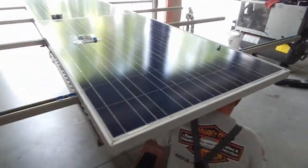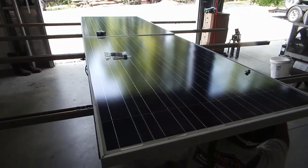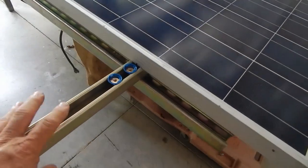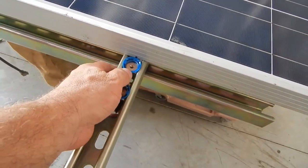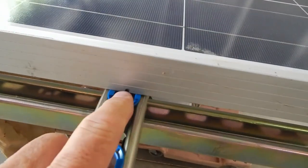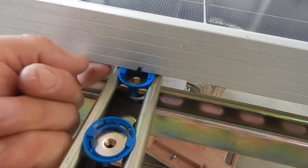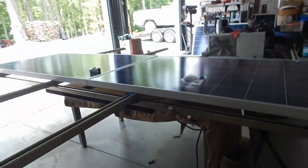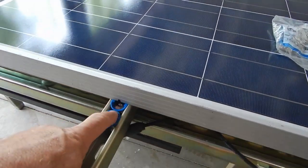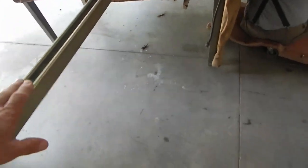We're back, moving along. We've got two panels up here to make sure these unistruts are correctly located. We're using these cone nuts — they slide underneath. There's a mark where the bolt hole behind the panel is, and we use quarter-20 bolts with stainless lock washers and washers. Then we bolt them again over here with another cone nut. There'll be another 250-watt panel here and another one over here.